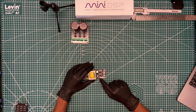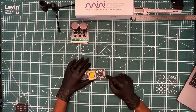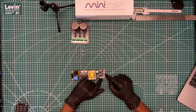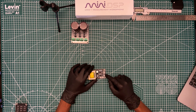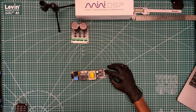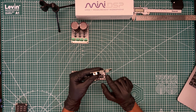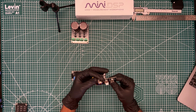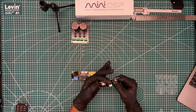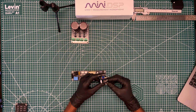The LED is for standby. You've always seen people providing LEDs when the power's on, but this has a standby LED. You can take the power-on LED from the PRO pin. These two — PRO and LED — give you 12V DC, plus and minus, so you can use them for lights, on and standby indicators, blue and amber, or anything. There's another part to this board — a trigger board — with 3.5mm mono jacks and a switch to go between auto and trigger modes.